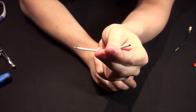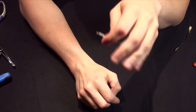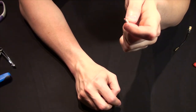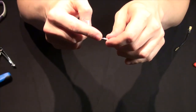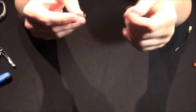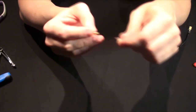I've got my stripped wire on both ends. A couple hints on stripping wire: you don't want to use too much pressure. You should have a hole size on your stripper made for the gauge of wire, but if you're not sure what the gauge is, be conservative. You don't want to cut a lot of conductors off. If you're finding strands of wire falling off, you might want to start again. Once you check that, it looks pretty good.